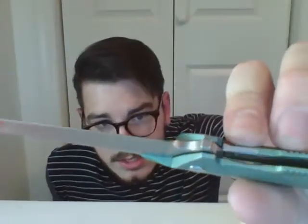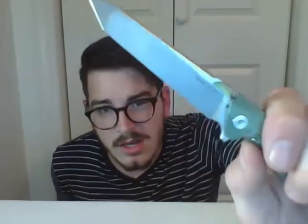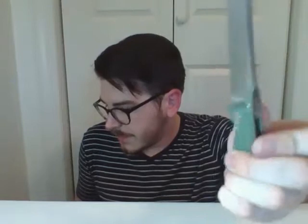This knife runs on ceramic bearings. It has a metal ball detent — the bearings are definitely ceramic, really smooth action. One of my nitpicky things on the break side: the detent is a little bit far from the lock bar face for my taste. There are occasions where you get it off the lock bar and it just hits the detent, and you're stuck shaking the knife because it's got to overcome that detent. When the detent is closer to the lock bar it's less of a problem — not a huge problem, but it does bother me a little.